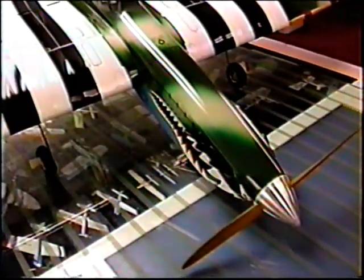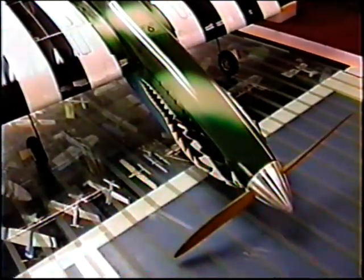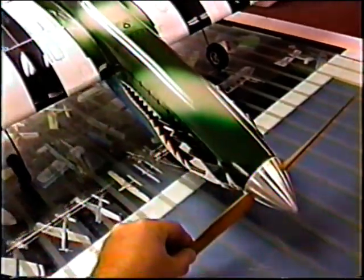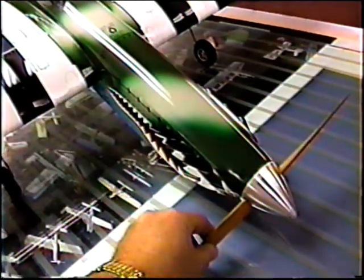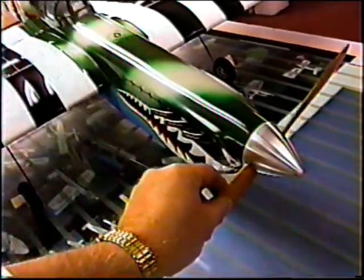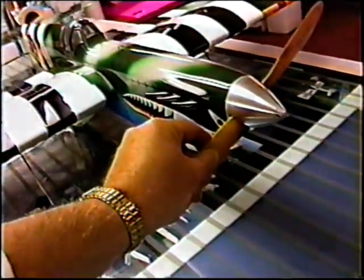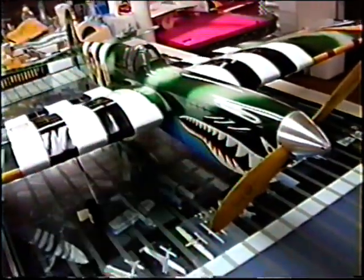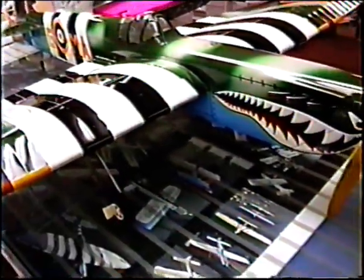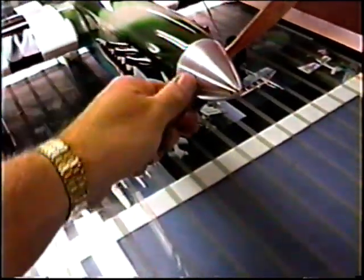Now, this is the way I establish what's going to be my gear for flying over tar. I want this nose to stay down. As soon as I pick it up just the least little bit, I don't want it to fall. That's going to be my place for starting with where I want these gear to be for flying over tar. To fly over grass, obviously I'd move these forward just a little bit. I want to make sure I still have the prop clearance I wanted.